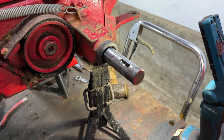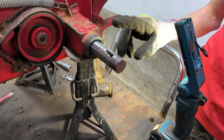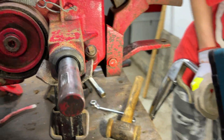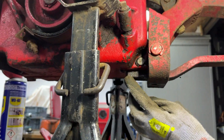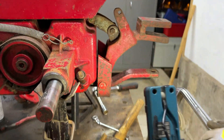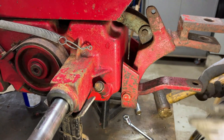Much the same on the other side in terms of condition. The last thing we're going to do before we change the oil seals is drain the rear axle oil, or whatever's left of it. That means undoing this allen bolt here next to the tow hitch. And since we're going to need to take the tow hitch off at some point anyway, we might as well take it off now so that it's not in the way.